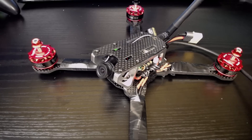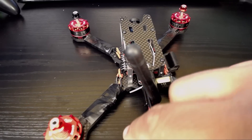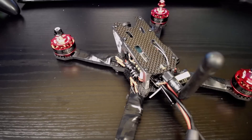I'm going to show you guys the easy way. Plug in the USB and have the quad facing away from you, and make sure the propellers are off because we're going to need to install the battery soon to check the motor orientation. Before doing all that, make sure your receiver is actually bound — that's one step you should do on your own and there are plenty of videos out there showing you how.